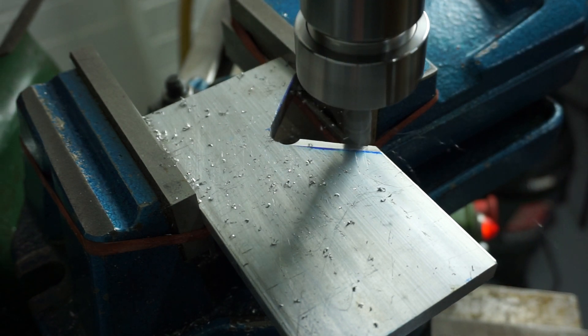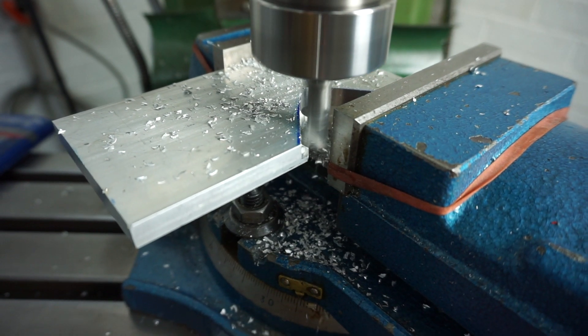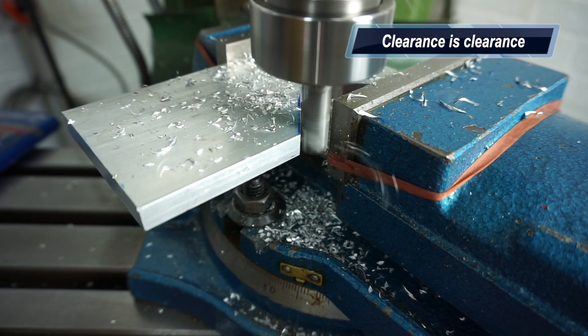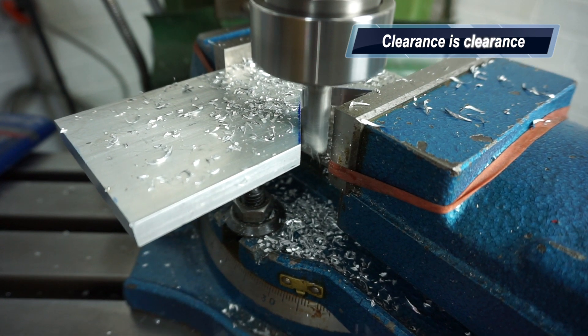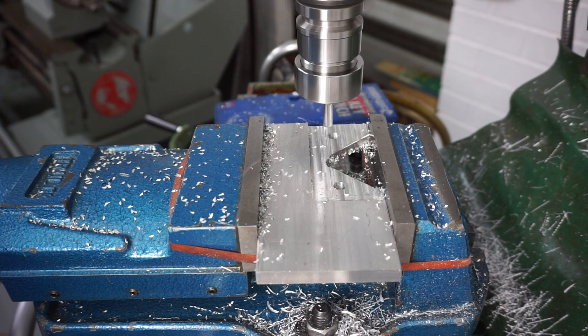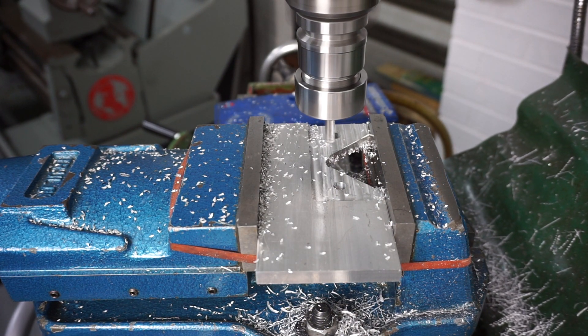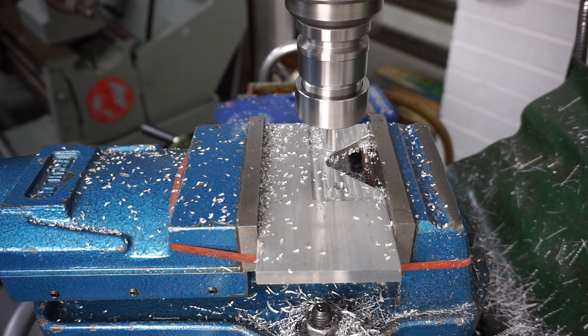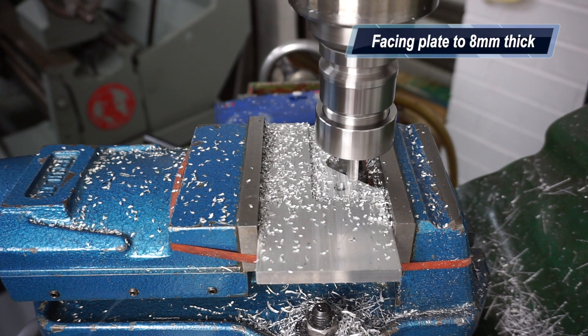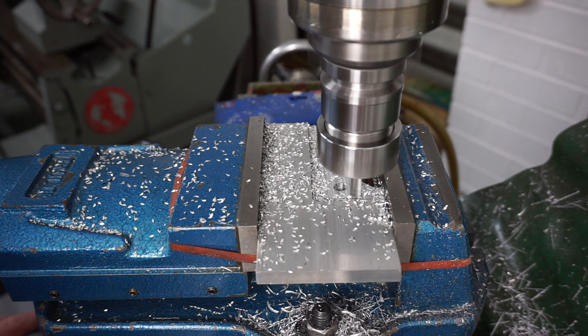Now I need to make an aluminium plate that bolts onto the barrel. This will allow me to adjust the timing chain and also mount other hardware like the coil pack. I was getting really close to the vice jaw but clearance is clearance. The plate I had was half-inch thick and I had to mill it down to about 8mm thickness to fit where it needed to go.